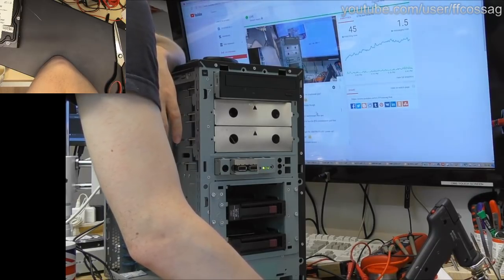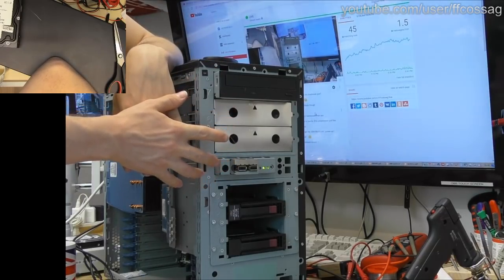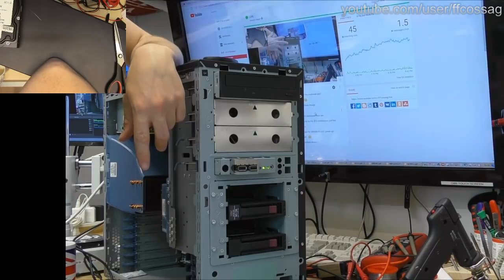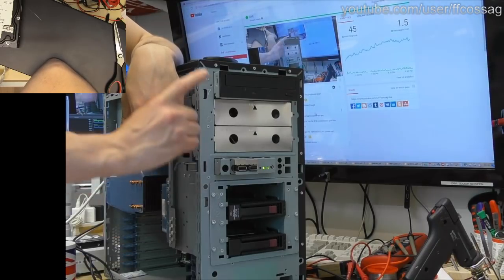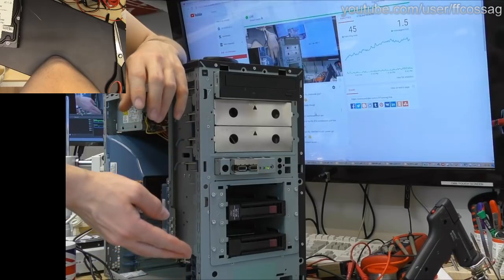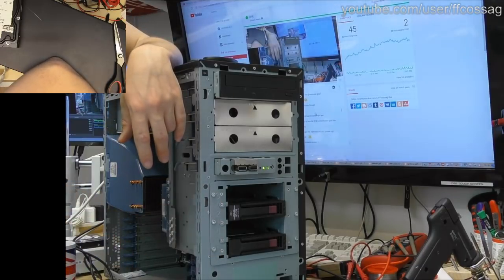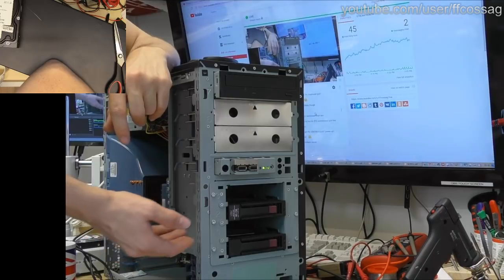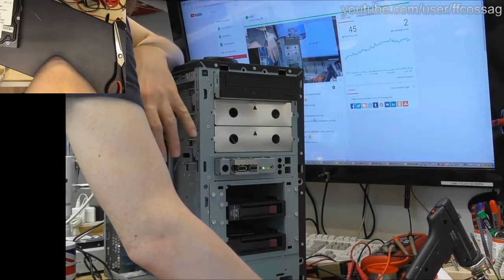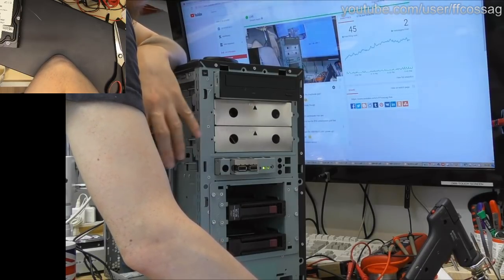Someone says, no ZFS dedupe with 4 gigs of RAM, though. We do not need that. This thing is replacing a machine which has a single 250 gigabyte 5400 RPM drive, combined with system and shares, which has been running for over 10 years. Two mirrored, 2 terabyte modern low speed drives, it's just better. And 2 terabytes is fine. This is going to contain backups from 3 small PCs and some database stuff. It's just super low power stuff.